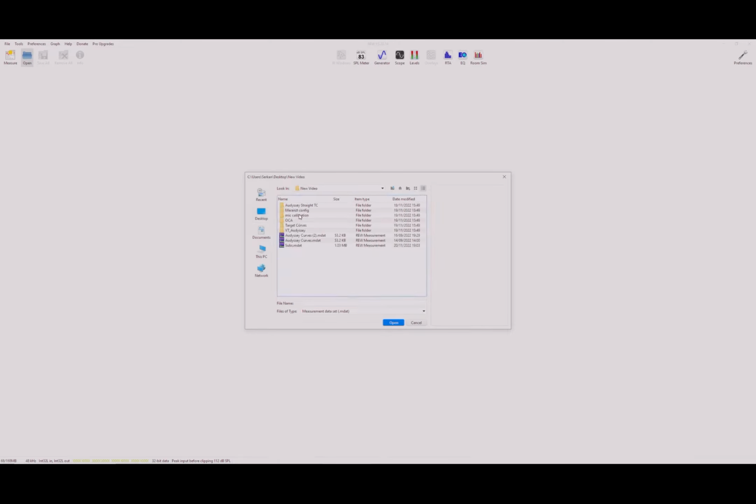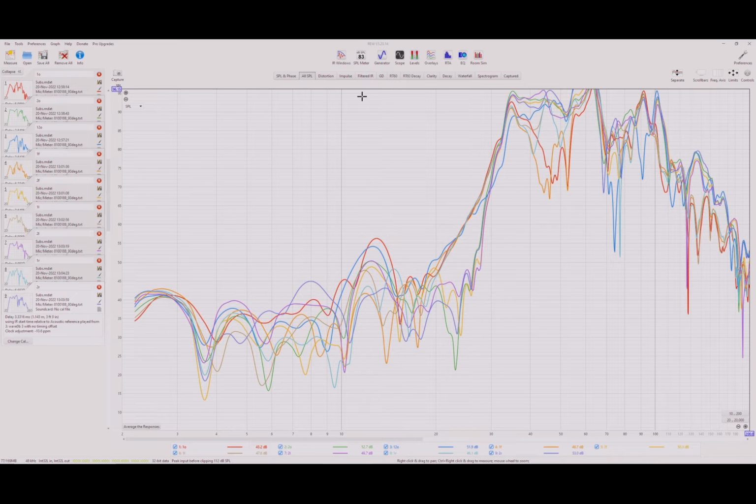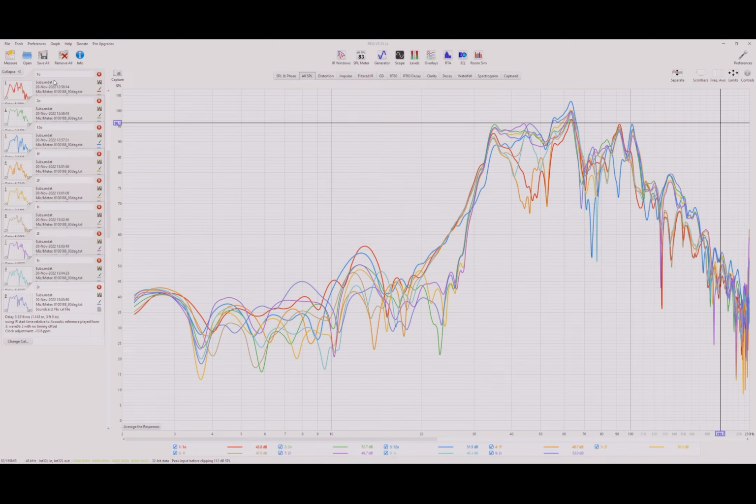We open measurements. So I used this lowercase o standing for 0 or origin, subwoofer 1 and 2, and 1, 2 together at the central listening position, position 0. And then I moved the microphone forward and I took two measurements with subwoofer 1 and 2. I called them 1F, 2F. And then I moved it to left. I called them 1L, 2L. And then I moved it to the right of the central listening position and I called them 1R and 2R. So I have a total of 4 different measurement points with two subwoofer measurements at each point.